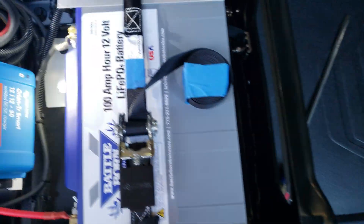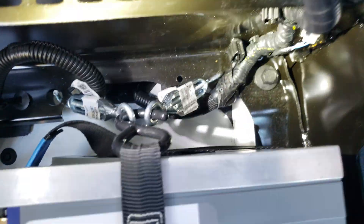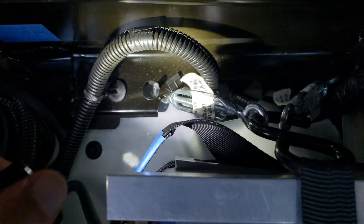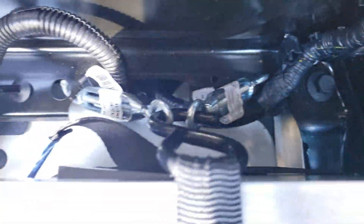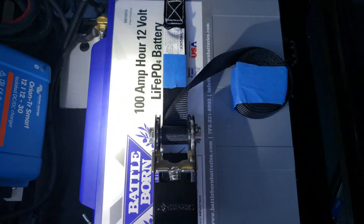The angle positions and locates the battery forward. So again, the strategy was to bias the whole battery into this corner and then hold it down — this is really the datum. Looking at the straps, I used two turnbuckles: one using this existing hole and another existing hole back here. In order to balance the forces, I wanted this strap to go east-west to push it straight into the side, so I used the ratcheting strap system for that.